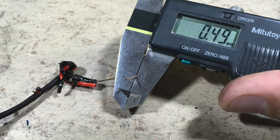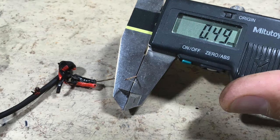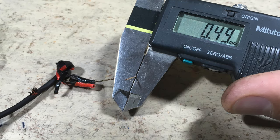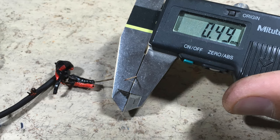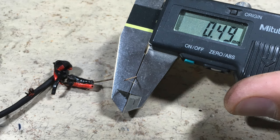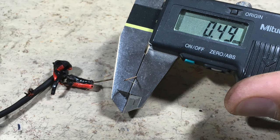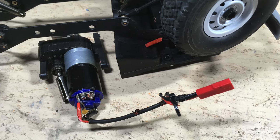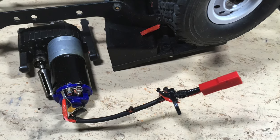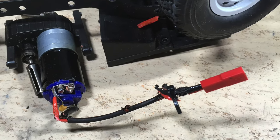But what does this mean? Well, this wiring will only be able to carry a continuous current of about 2A. No wonder it overheated at about 9A maximum current. The shrink tube protection I added made the overheating issue even worse. Bad idea.